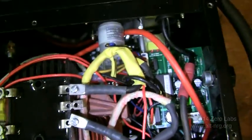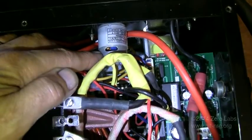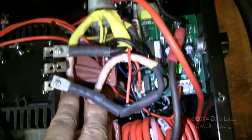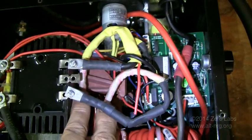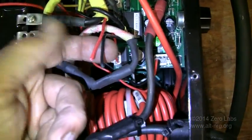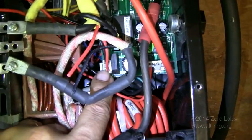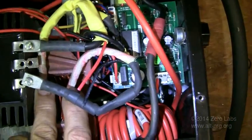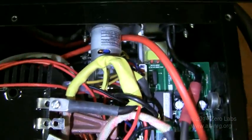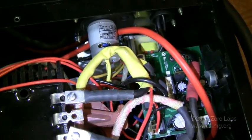One of the deficiencies of this MIG welder is that the power supply for the motor that drives the wire through the cable to the wand took its power directly off the secondary of the main transformer. So you had roughly 24 to 28 volts AC depending on what power level you selected, and the problem is when you start welding, the voltage on the transformer secondary sags. When the voltage sags, the motor speed sags with it, giving you a very unsteady feed rate — and that is very undesirable. You want a set feed rate you can count on regardless of whether you're welding or not.